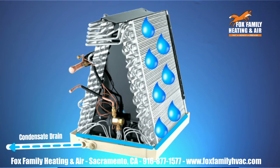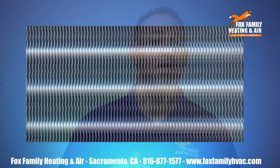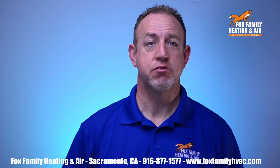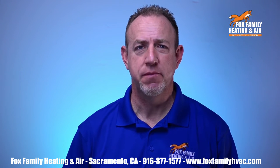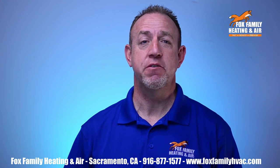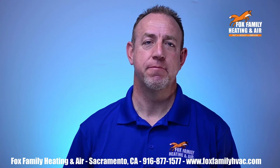Now, evaporator coils only have so much room for air to pass through when the AC is on. They have very thin blades for the air to pass through. If the coil gets too wet, the blower is getting a lot of resistance when the unit is trying to push air, so the dehumidification process becomes more difficult, cooling the house takes longer, which increases the electric bill for your home. Whew! So how does Comfort-R work?